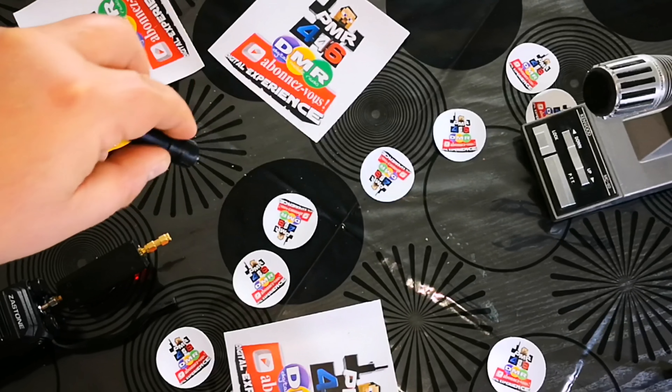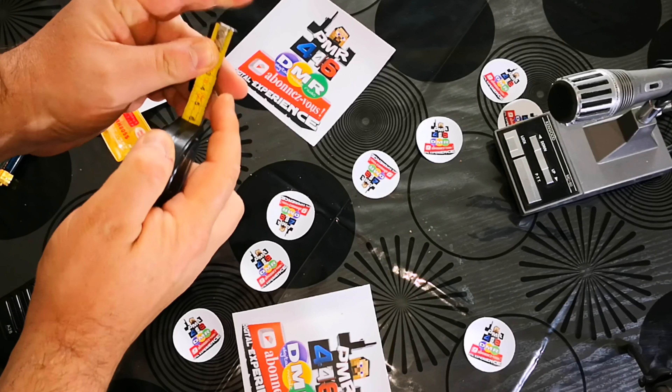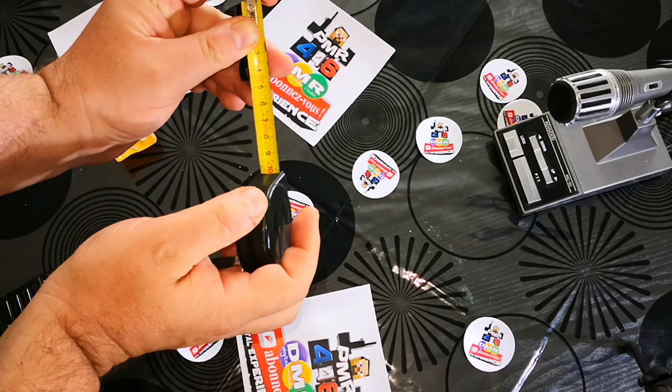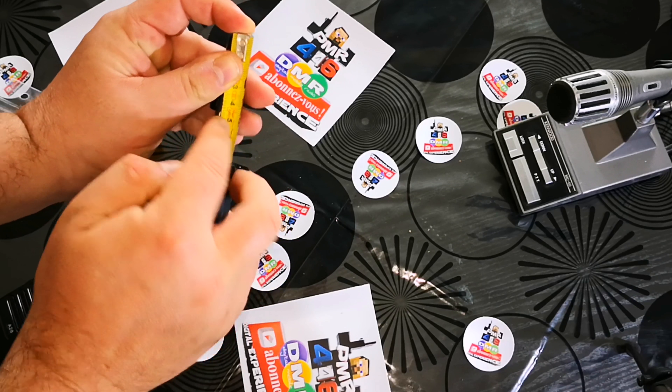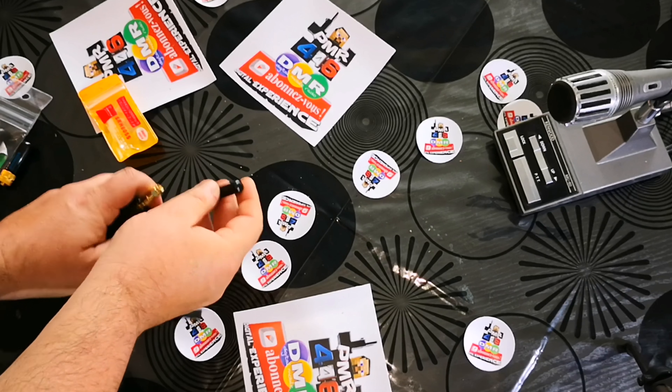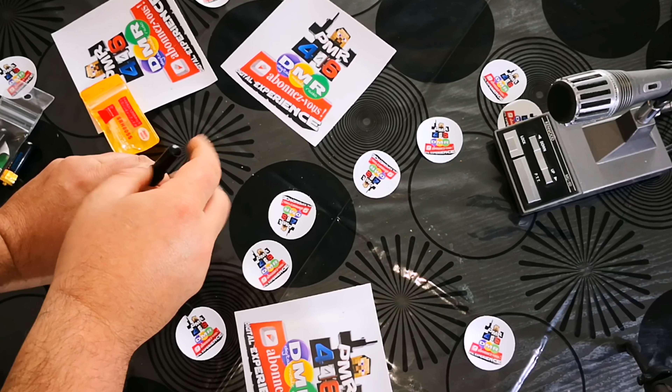Power low. We bring down the power — and there, we have a slightly lower SWR. But it's better to test at high power. So 2.9. I'll put the links in the description for these antennas. And price-wise, these are fairly expensive antennas.